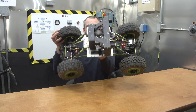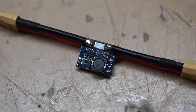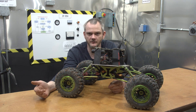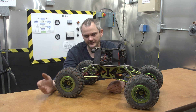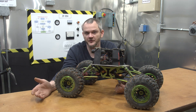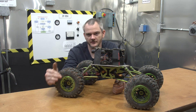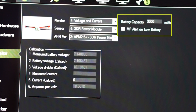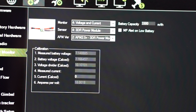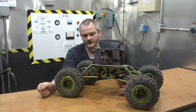The power module is another feedback device — it also supplies power to the APM, giving it its own clean power supply free from servo noise. This unit tells you your voltage and is also a current sensor; it plugs inline between your battery and your ESCs. With voltage and current data you can do a lot of things: you get immediate feedback on battery voltage, you know how much current you're currently using, and you can program the APM with your battery capacity — say 5,000 mAh — and if you put in a fully charged battery it can give you an estimated run time.